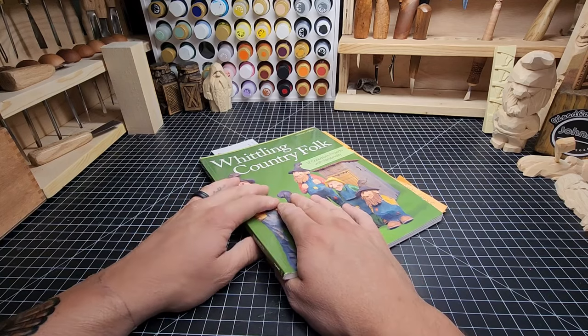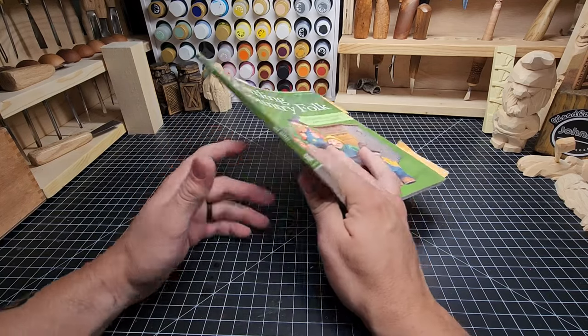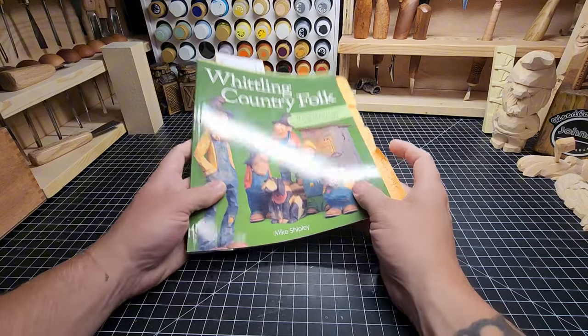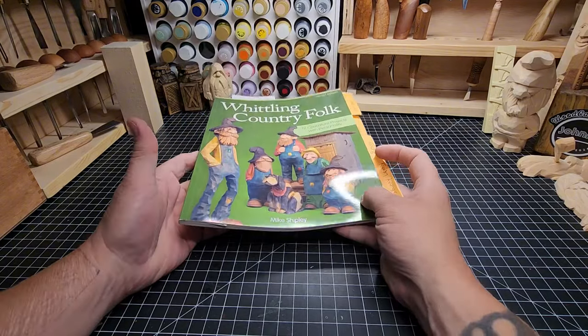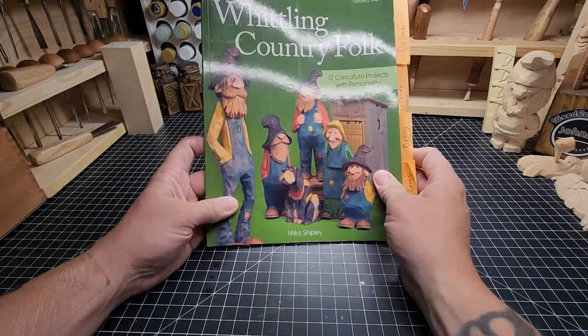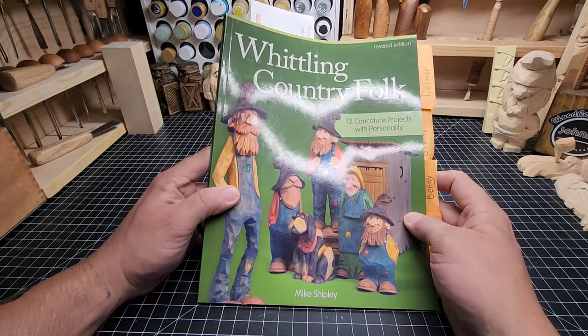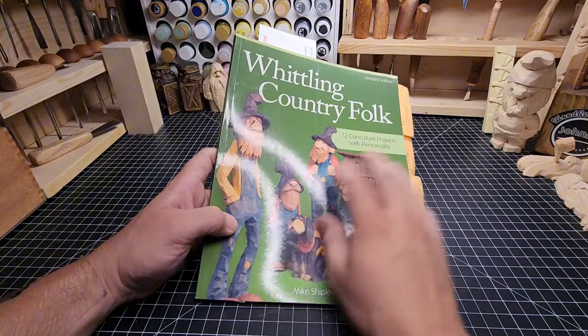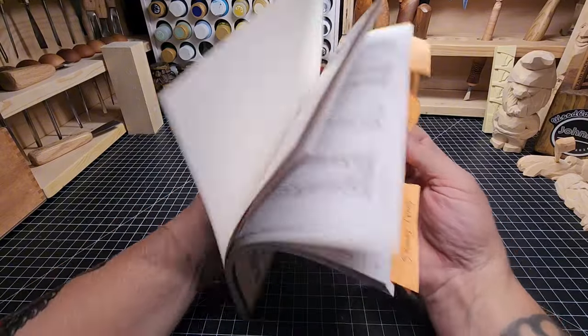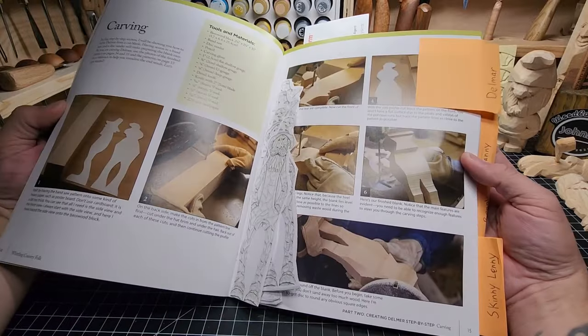John and Creason is using orange oil and raw umber paint mixed into Howard's Feed and Wax. It's all basically the same thing — a little bit of paint with some kind of vehicle to deliver that paint onto the carvings, like an oil-based paint. We're going to use boiled linseed oil, mineral spirits to dilute that, and then that oil-based paint is mixed in and diluted as a vehicle for delivering it.